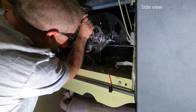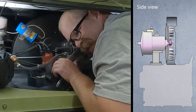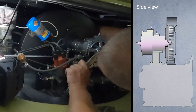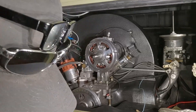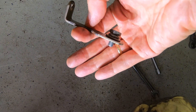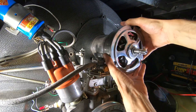This is how we got the alternator out without removing the shroud. Clip the shaft to stop it spinning and remove the 36mm nut holding the fan to the alternator shaft. This was the most difficult part of the process because it was not easy to access the nut — it took a while, but Casey was able to get it off. Next, we took off the four screws that hold the plate to the shroud. The throttle linkage stand was supported by a small hardware piece attached to one of the four screws, so we had to remove that. Then we took the strap off that holds the alternator on the stand. Now we could pull the alternator.